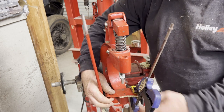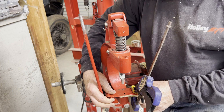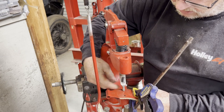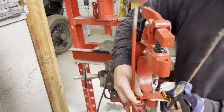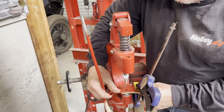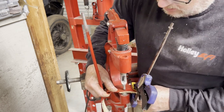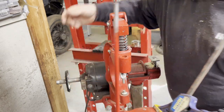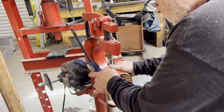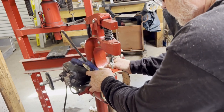I put all these on the holes — I'm kind of doing this backwards. I took off the tray because this tool is normally made for a brake shoe to go on top; since this is going underneath, I took the tray off so I could film it better. When you get it centered up, this is the little rivet tool and you press down on it. Once I get it set down on the deal, I push the rivet tool down. Here's how it works from the front — just get it seated down on there good. Perfect crimp every time.